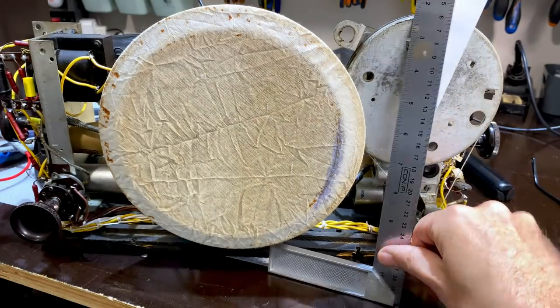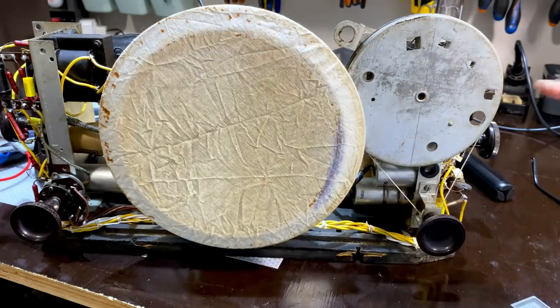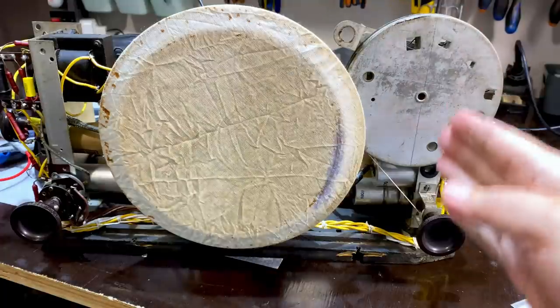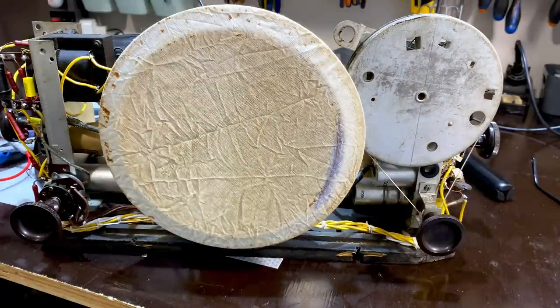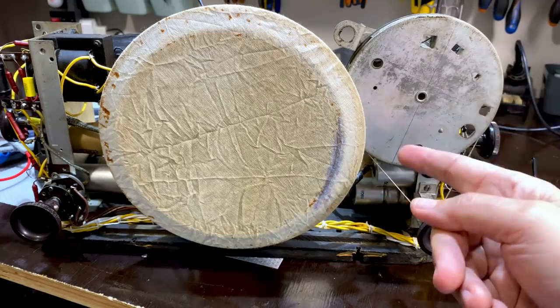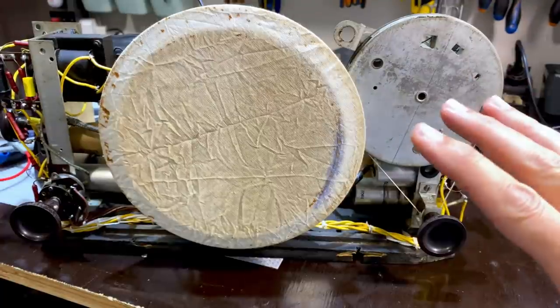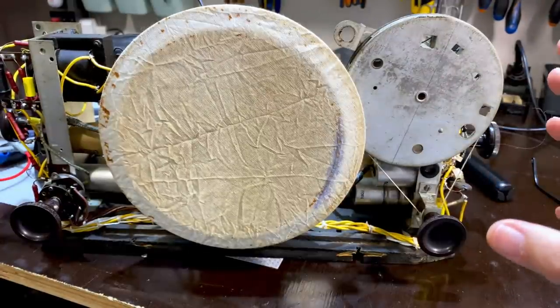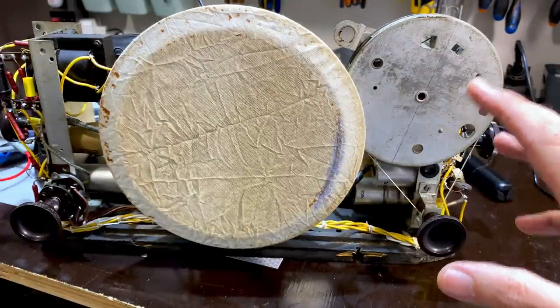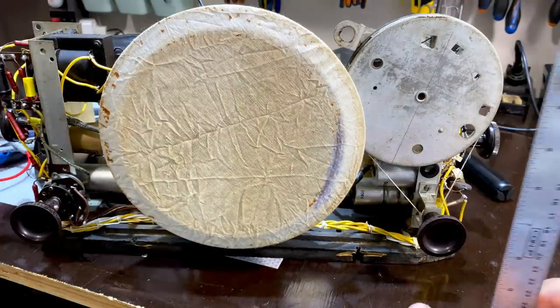This is my gadget. So what have I done? I've made a line down the middle. I think you can sort of see it there. It's in pencil. That is perfectly vertical using the set square. And they tell you to turn it 15 degrees. Now, when you turn it 15 degrees, that should be at the 200 meter range. There's a little discrepancy that say 200 meters, and then you're supposed to send 1442 kilohertz, which is not quite right. But we are doing approximates here because this thing is by no means a digital device.